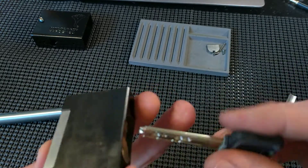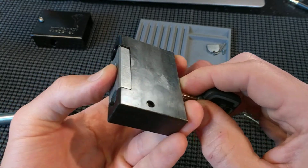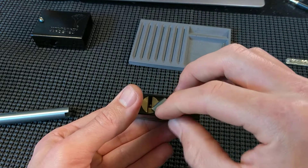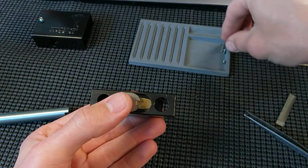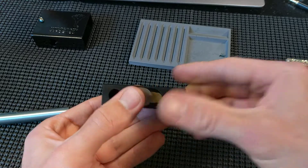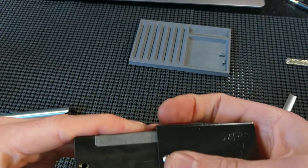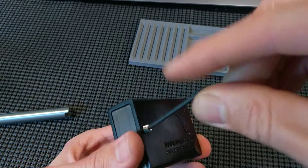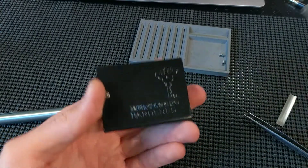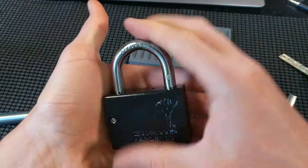Test your key. The tailpiece — I should have screwed it on, but in the interest of saving time I didn't. It's fine. Then we need our dust cover. This goes on, kind of slides back and forth like that with the spring — it looks a whole lot like a driver spring, but they're different, so pay attention. Then this slides back into the body. Tighten this down real quick. And there we go, it's reassembled. Throw your shackle back in. It's good to go. That wasn't so bad. Have a good day.